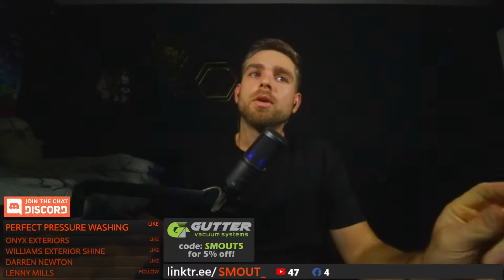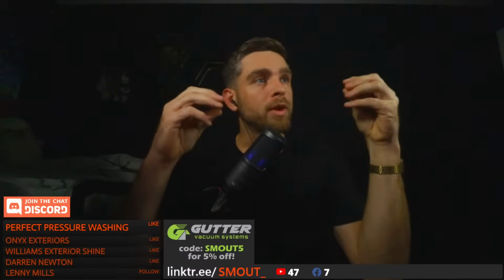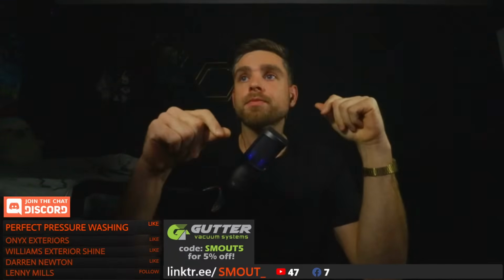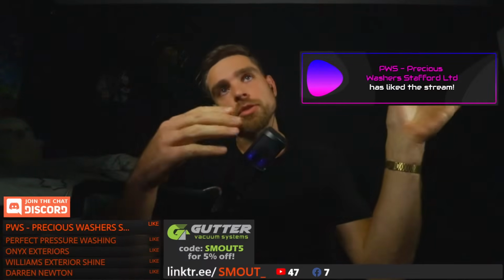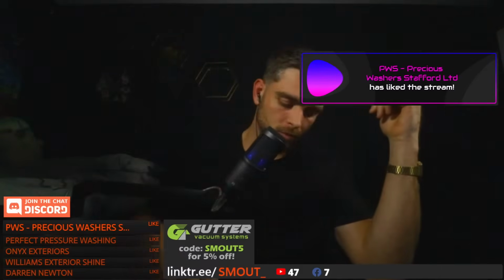The other thing that people do, so if you've got a drip from the bottom of your buffer tank or from the bottom of your hose or whatever, the other thing is that hose needs to be nice and thick, generally like a clear 3/4 inch wire reinforced hose, so that it can't squish under vacuum. And you don't want it more than around about 1.5 meters long. Any longer than that and it's going to struggle to suck the water through.